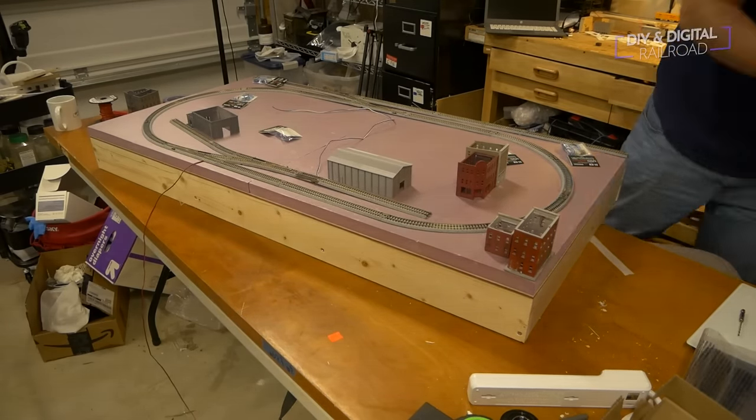We are going to install lights for the building interiors. We will be controlling them with these switches. We will be installing four of these switches total for lights, so I started drilling the necessary holes with a 7/8 inch spade bit. I then put the switches in the corresponding holes I just drilled. I also install another bus, but this time it's for my lower voltage 5 volt lights, which will be my street lights. One good tip to remember is it's always good to try and clean up your workspace as you go.